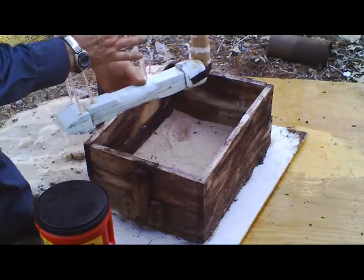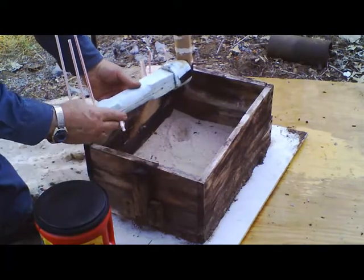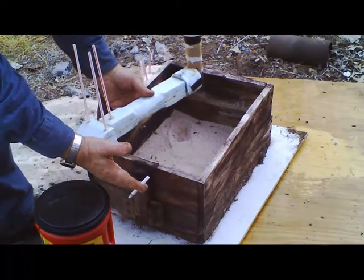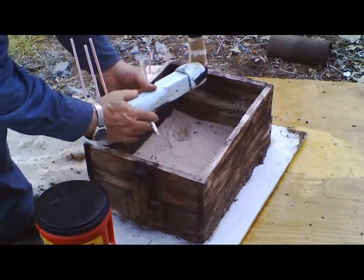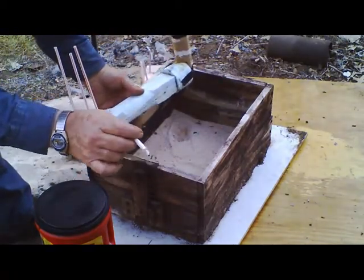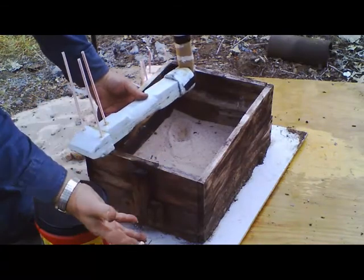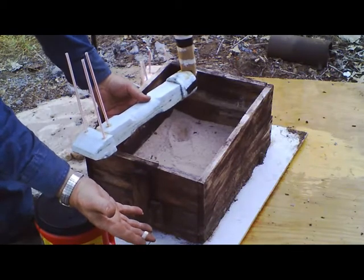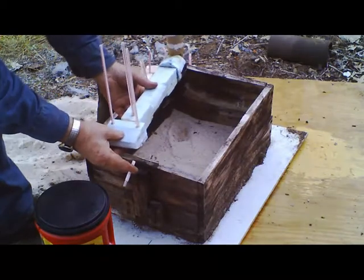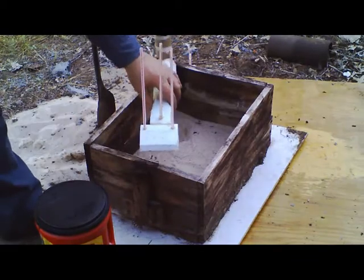In that joint, you do not want sharp edges — you need a radius. Also, when you're doing a green sand casting, you will have to bevel the outside edges of your pattern just two to three degrees, just to make it release. It also makes it easier to take the mold out of the sand. But because we're doing dry sand and foam, we don't have to worry about that.